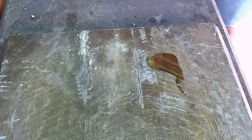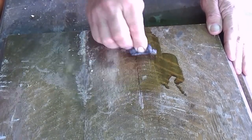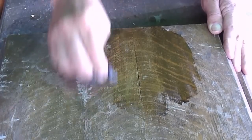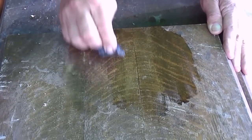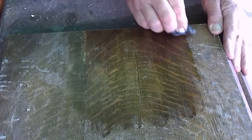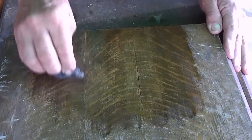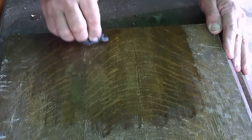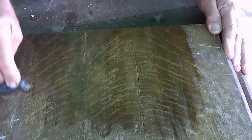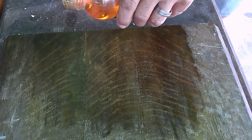You don't need a hell of a lot, so we'll just do a little bit there. What we're going to be doing is with the steel wool, it's actually going to be lifting the scaly, or the old shellac, and just replacing it with the pale boiled oil. The reason we use the pale boiled oil is because the linseed goes inside and treats the actual timber underneath, but on the outside, where it hits the air, it'll actually harden, like tung oil.